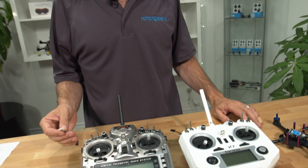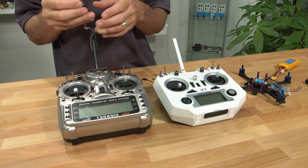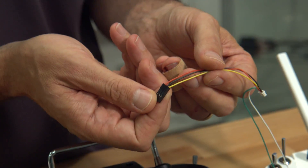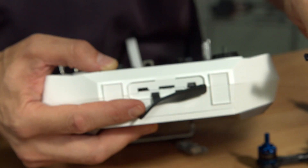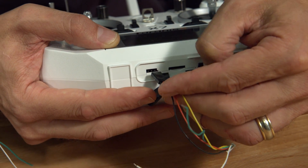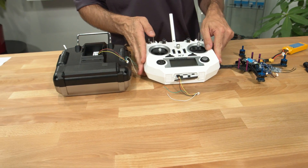With the SD card and the radio ready, we're ready to hook the XSR up and give it a flash. You need the cable that came with it. It's important to note that in each case we're using the red, the black, and the yellow wire, but the order of the wires is different between the Taranis and the QX7. On the Taranis, we make our connections with signal at the bottom, ground is the next one up, and then red above that — going into the bottom three pins. For the QX7, the black wire ground is on the outside, power is in the middle, and the signal wire is on the inside by the SD slot.